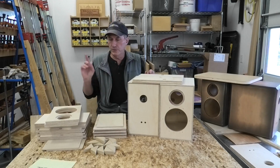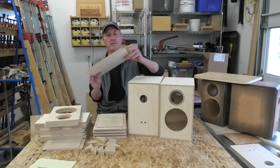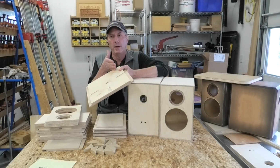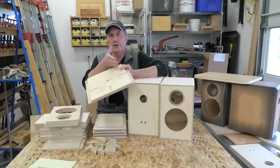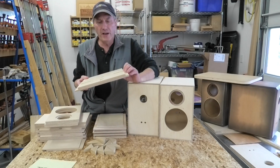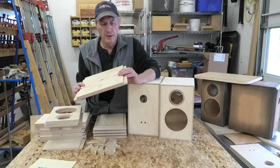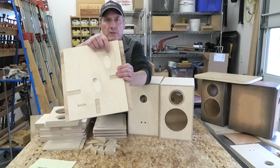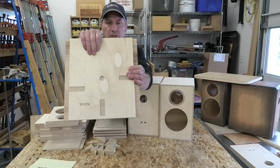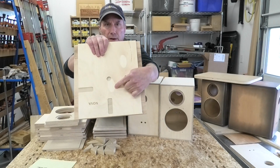And the one thing I want to point out, two things I want to point out, and that is the way that Baltic birch is made. So it's a one piece, what they call a rotary cut face. So there are no seams of veneer in the face. I won't get into a whole thing about how it's made, but suffice to say that it's a seamless piece from one side of the sheet to the other. But within that seamless piece, there can be defects, and they'll plug those defects. And I'm going to hold that up and point my finger towards it. That little football-shaped thing you see there, that's a plug. And they cut out a little pin knot or something there, and they plugged it. And there's another one right there.